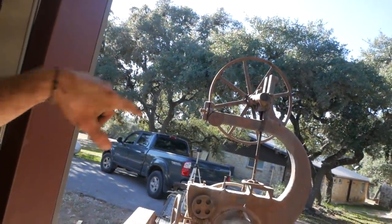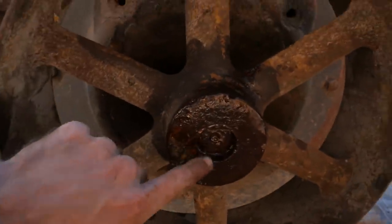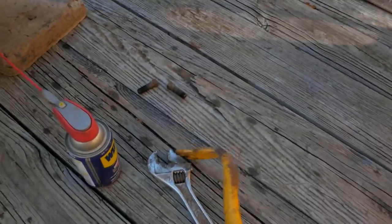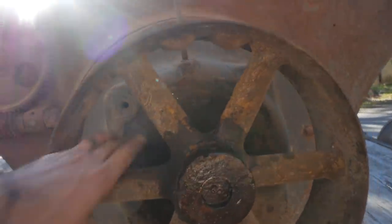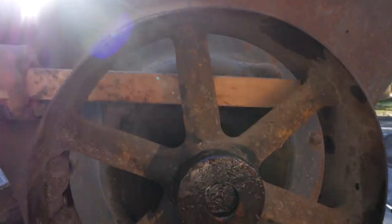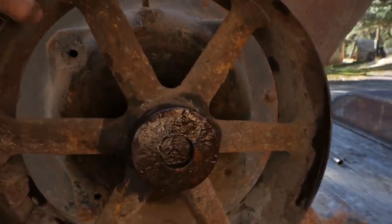The top wheel — I've got to figure out how to get it off. It's loose; it's on a dovetail, kind of like a sliding dovetail up there, so I could slide it off with some help. The bottom wheel down there, I don't know how I'm going to get that off — it's pretty stuck. I've gotten it about a half inch off the shaft and it is not budging. I snaggletoothed my crowbar. I have a little concern leveraging back there on it. I've got a board to help even the pressure and hopefully not do any damage, but I'm not sure how I'm going to get this off.